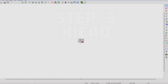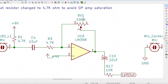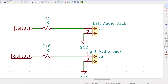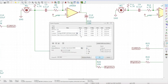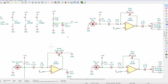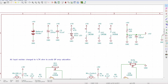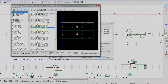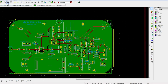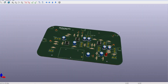I jumped straight into KiCad and, since I really like designing circuits and boards, I was thrilled. I made sure to add capacitors for filtering the power supply section and added summing resistors, since I wanted a right and left output so most of the microphones would be combined depending on the panning. I also needed the possibility to control the gain as well as the panning on two of the electret mics. After a whole night of design the circuit was ready, the next night was spent on the PCB layout. After double-checking everything, I sent it over to JLCPCB — not a sponsor — and waited about a week.